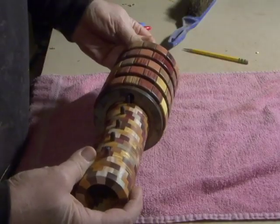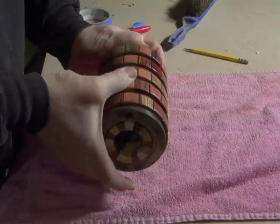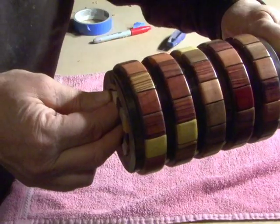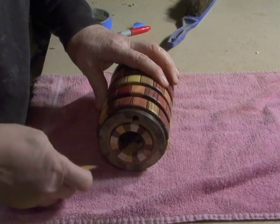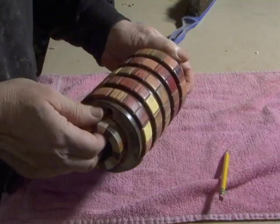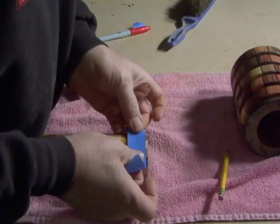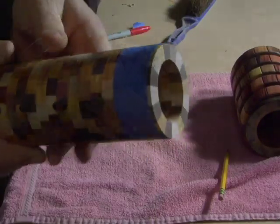The first step before turning the dome lid is to determine how deep this container top goes into the lid. So I've put it into my Cryptex here, I've turned my locking rings, and I'm investigating just how much play there is, how much will it move back and forth. It's less than 1/8 of an inch. So I've split the difference and marked the location, which will put those pins centered between the locking rings. I'm now putting tape on there on my pencil line. This tells me how deep into the underside of the dome lid to glue this container into place.